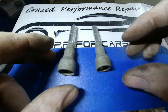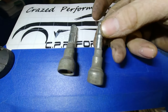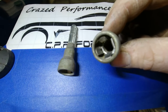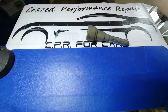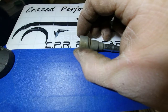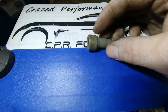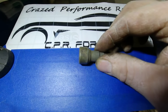Another extremely common connector is this type — a fuel line connector that would be attached to plastic line on one end and a metal line on the other. The metal line has a barb on it with little clasps on the inside. Some of the newer designs have a little plastic piece sitting on the metal line — all you need to do is pull that plastic piece and it will disconnect the line. Those are a very nice design.